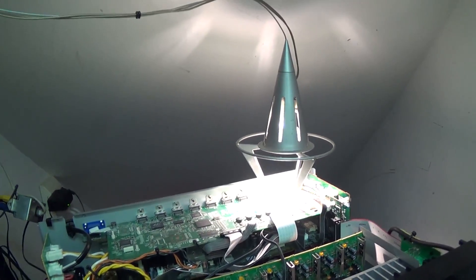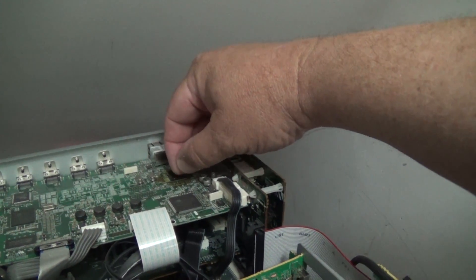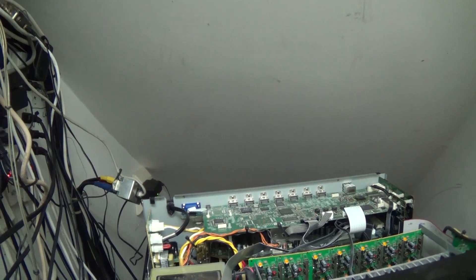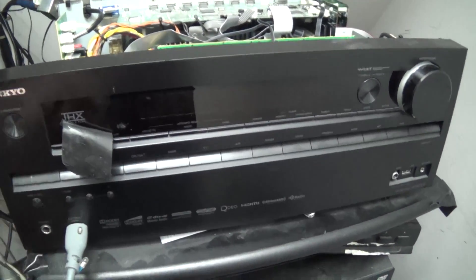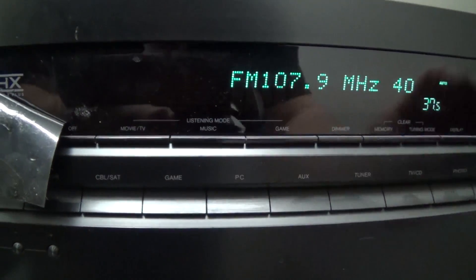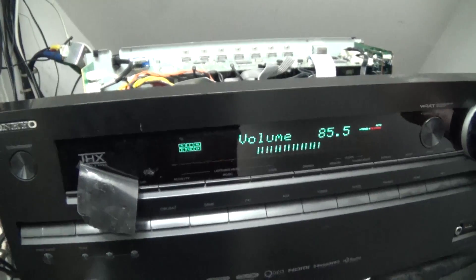The lamp's been sitting here for a good hour. Let's shut it off and see whether we've got enough heat on the chip. The chip's pretty warm — it didn't get hot enough to melt my sacrificial solder, but I can smell the rosin was burning pretty good. Let's plug the unit in and see whether we have lift off. Hit the power button — now we want to see if the speaker lights are going to come on. Oh, look at that — speaker lights come on! Let's see if we've got some music. I think that's a pretty good answer — yes!